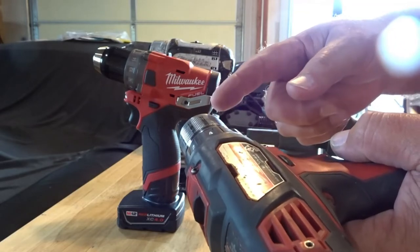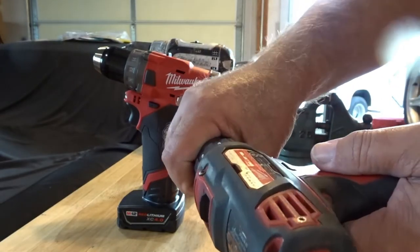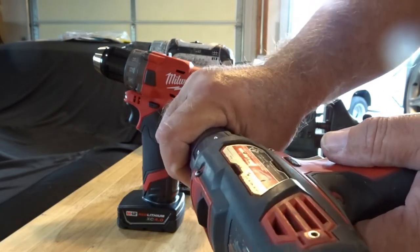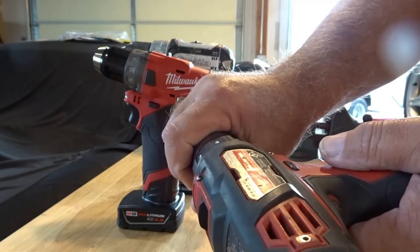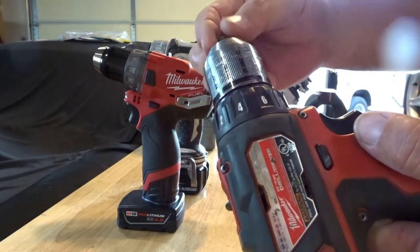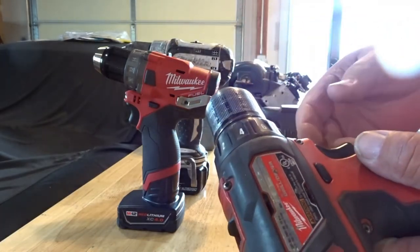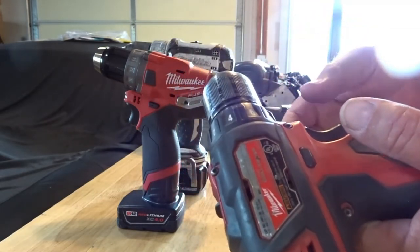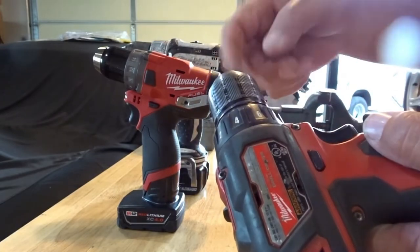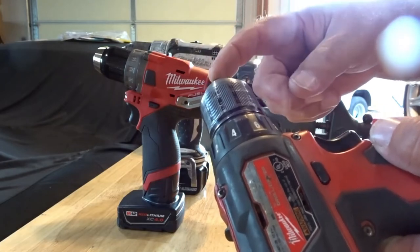On most of these style drills with a ratcheting chuck, if you take the chuck and pull it just one click back, you can hear that audible click. When you click it back just that one tooth — just until you hear that click — now the chuck is locked. Now it will not unscrew. So if you're drilling into masonry or metal or whatever, and you've had that drill bit come loose where it starts spinning on the bit when the bit gets resistance, that won't happen with this.